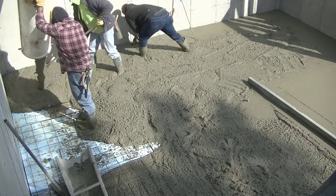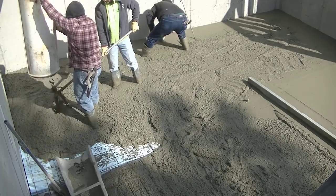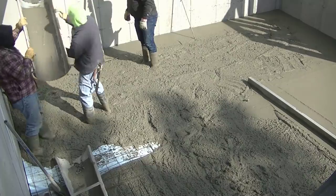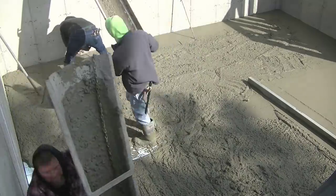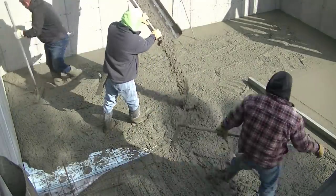We decided to give him a few more gallons — it was kind of stiff, drying up pretty quick, so we gave him five gallons just to get the concrete a little bit looser. Now you can see us changing that chute around — see how easy that is? That makes it pretty convenient for pouring concrete. Get that eight-foot chute out of the way just for a minute.